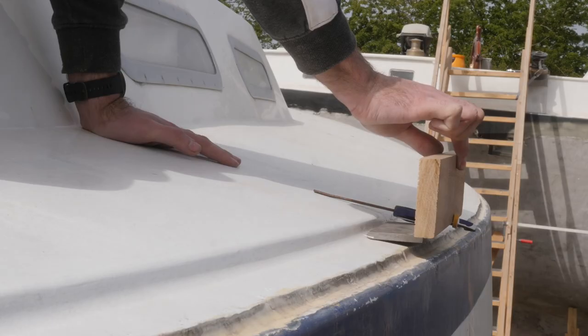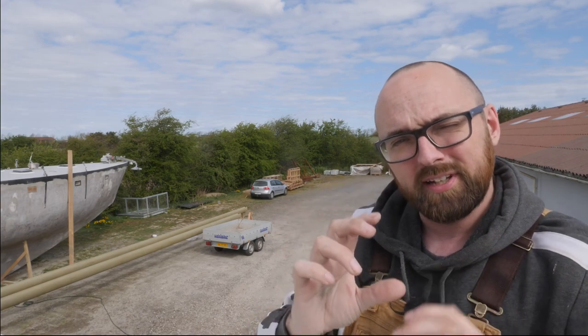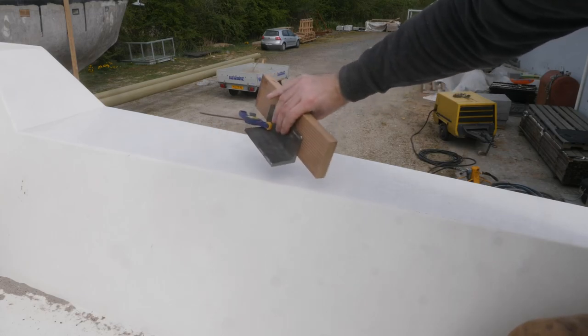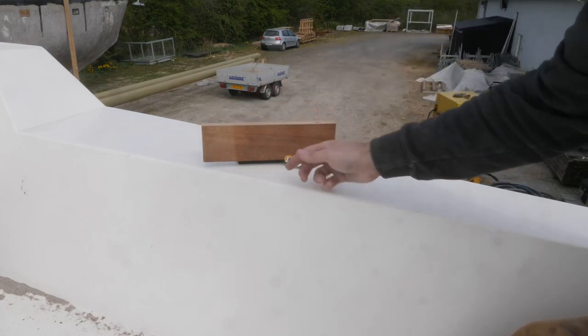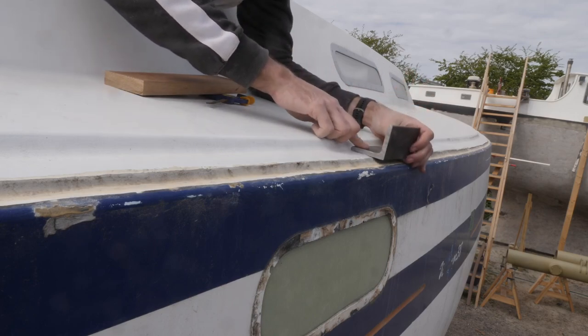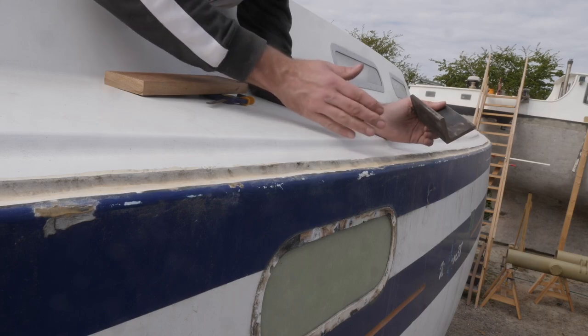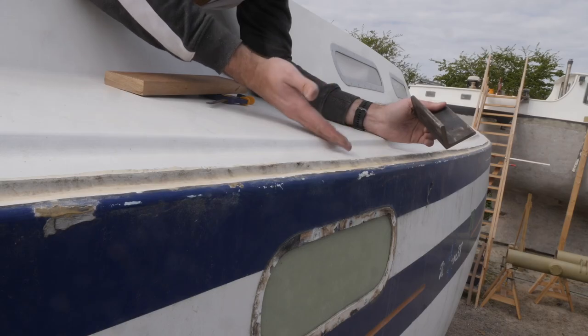I know it's kind of difficult to picture from just that small sample but I found some photos on the internet of a guy that did something very similar — he added two boards and ended up painting them, and I think that looks pretty cool. I'll include a link to his blog in the description. There are some other upsides: water will have a very easy time draining from the deck. I'm picturing something the shape of this, roughly a little bit narrower, maybe one every 50 to 100 centimeters, so it's going to mean a lot fewer holes than a traditional aluminum toe rail. I think mini bulwarks are a really good compromise between not wanting to spend five grand on an aluminum toe rail and not having a lot of time, because Athena does need to be ready to start cruising in around a year.